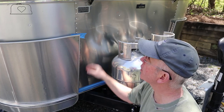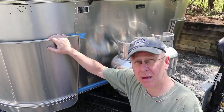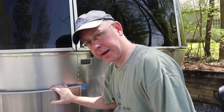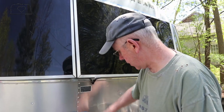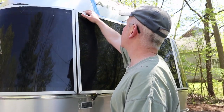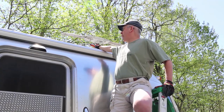We used a lot of painter's tape to block any water ingress, but so far it doesn't seem to have helped at all — so it doesn't look like it's coming from here or from this seam down here. Part of troubleshooting is trying to narrow things down. You get a big funnel and you're trying to bring it down until you find that piece you need.